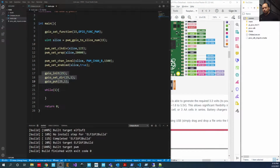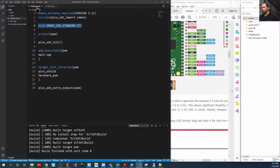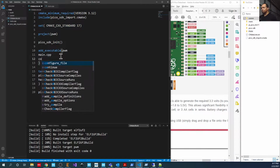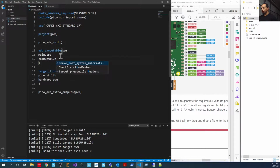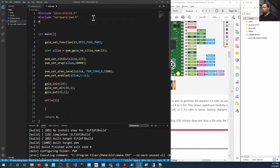So let's go back to the code and let's add a class. This is code that we added on the previous examples. So we don't have anything yet. The classes are here. The link for the download will be in the description. So this is the one we need, but we're gonna add everything, just the entire folder. So we'll drop it and say copy. And now that we have it, we can go to CMake lists, add it here, hm11.h. And that one uses the hardware UART. So now we can go to main and add it.